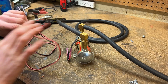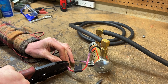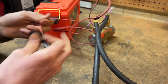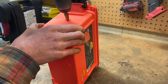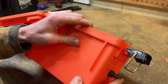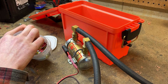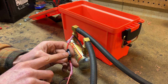I'll be putting a ring terminal on one of the base plate screws for the negative connection. I forgot to add a power switch — I'm thinking right there. I don't really have a nice inline rocker switch like I was thinking, but this is what I have on hand so we'll give it a roll. I did go back and review the specs for this pump — they say to use a three to five amp fuse, so let's find a three to throw in there. I've only got threes in the mini fuse size, so that'll have to do for now.